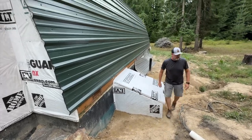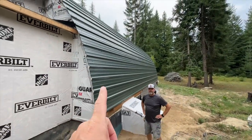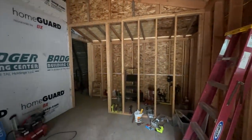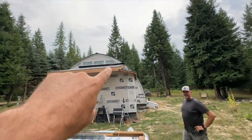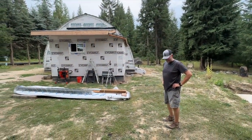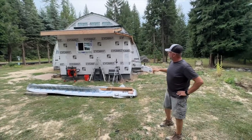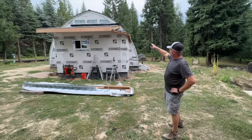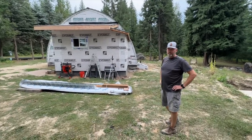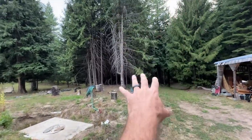It's cool. So you're building an arch cabin here on your homestead. Yes. So this is a 30 by 40. They got this cool bump out here off of the back, and it's got a pretty unique roof line where it comes down this way and comes off over there. So it's like high style. Yeah, I hurt my brain trying to figure out how to do that so I wouldn't pierce the metal out there. But so I got a 3/12, and then this is probably 2.5/12 this way. And I got my metal in, so if the weather cooperates, I might be able to get that up this week. They've also got a cistern here that runs down to a well way down over there.